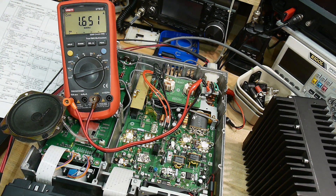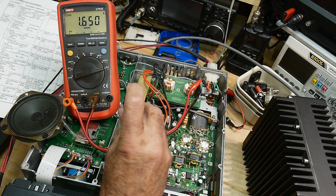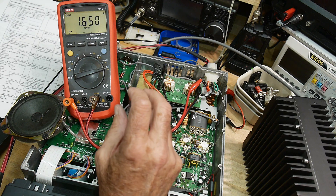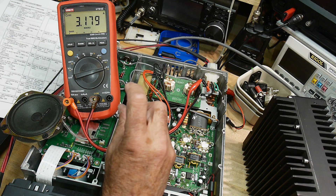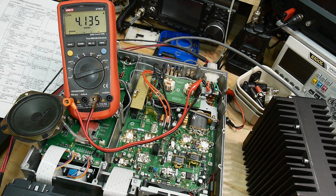We can transmit, and we get 3.1 amps. We're going to take that to 4.1. We're on this resistor here — 3.16, so we need 4.16. Went past it — 4.16. Let's call it quits. So I claim that we have just adjusted all of the biasing for all of the amplifiers. Looking good.